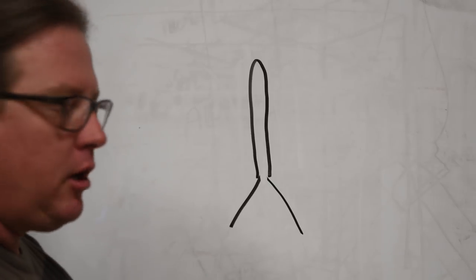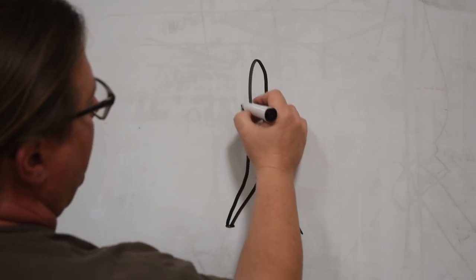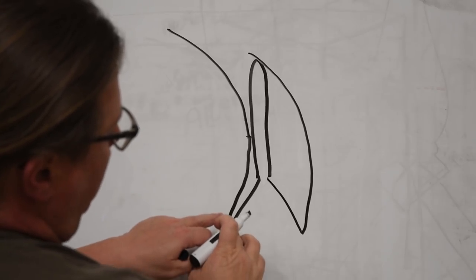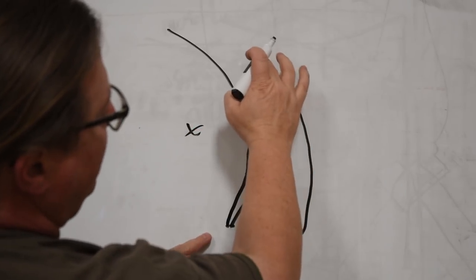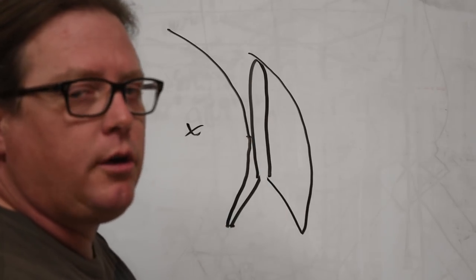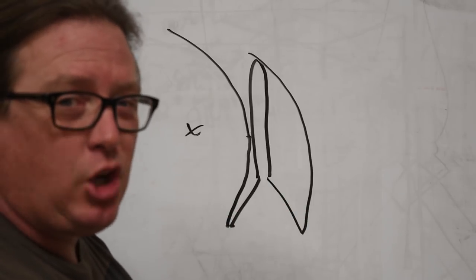Whenever you're going for the tightest curve you can possibly cut on a bandsaw, it comes down to where the interior tooth is curving. If you're cutting a curve one way, it's going to touch the blade in the middle somewhere and then curve out, whereas cutting the other way is going to curve around and touch the back side. So if you're watching your curve, watch the line on the inside tooth so it follows and pivots off the back side. If it's not touching the back side, you know you can turn a little bit tighter. If it is touching the back side and you try to turn quicker, all you're going to do is twist the blade on the bandsaw, creating a lot of heat — it's going to be twisting in the bearings and it will eventually break. Or your bandsaw will actually bind up and stop.